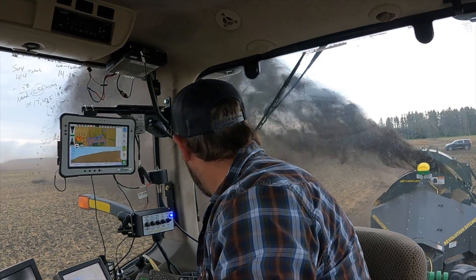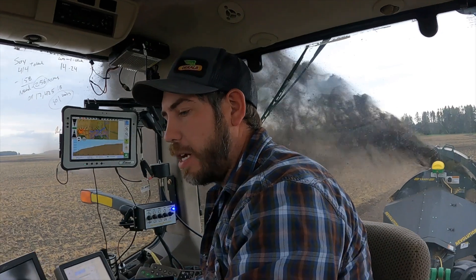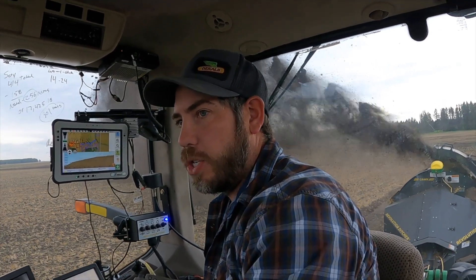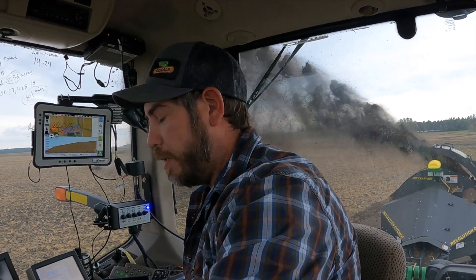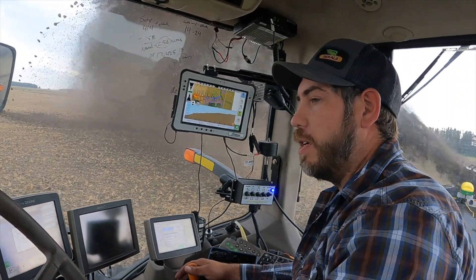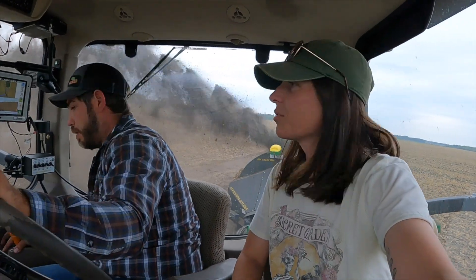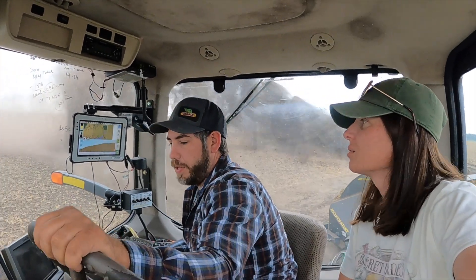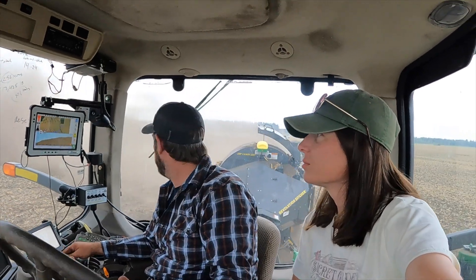We're doing three passes wide here. I survey it and then I cut it back, do a cut on each side, then come back and tilt the machine a little bit and do my back slopes. I don't usually have to have a very deep ditch because there's so much fall here — one pass for a back slope is sufficient. The tractor we have on here is 360 horse — it's a 310 turned up. How far does this ditcher throw the dirt? At full RPM it'll throw it 150 feet. No more left side or right side — it switches. I can switch it if the wind is in the wrong direction, which is really nice.